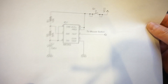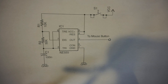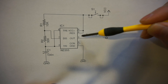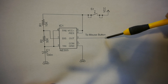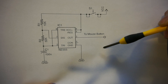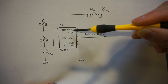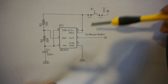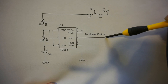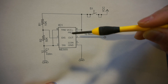Here's a simple circuit I've come up with that can simulate the mouse click. It's just a simple 555 timer in an astable oscillator configuration. The idea is to put a switch in its power supply path and connect the output to the mouse button. Whenever the button is engaged, the output pulls the button high and low repeatedly. This works because the output pin of the 555 timer is a push-pull configuration, so when disengaged the output is high impedance and won't affect normal mouse operation. Let's put this circuit on a tiny protoboard and see if it works.